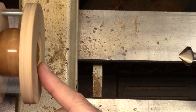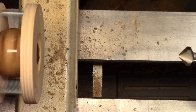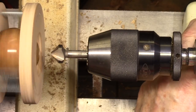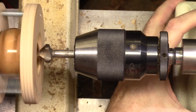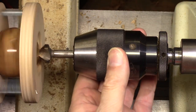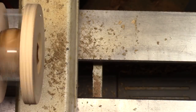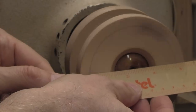you can't really get the bevel on it to really control it, and it's very easy to get a cut back. But with this cutter, I think it might be a milling machine type of cutter. It's got 3 flutes on it, and it has given me pretty reliable holes that go into the center and don't move off. And I want to go down and have a cone that has about a half inch diameter. I want a cone that's going to be about a half inch diameter across.